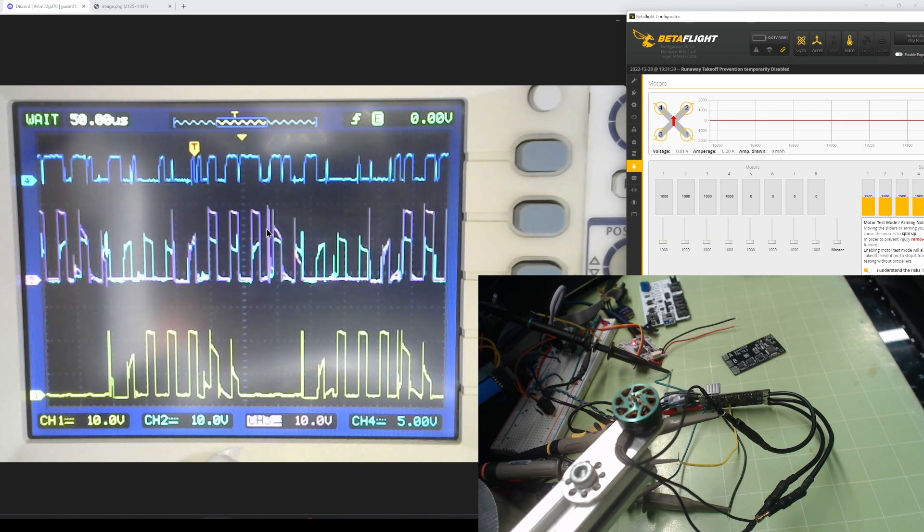So the signals look always the same — it's repetitive. You have your gap here because the duty cycle ended, and then there was a commutation event right after it as well, so it made the gap even bigger. At this point you get false positives. Here's your interrupt — you check to see if the line remains low for whatever period you calculated based on your voltage and duty cycle, and then you commutate. There's another pulse here, but that's irrelevant, because you can see the purple line — you have already crossed your virtual ground, and you commutate and don't check this again.